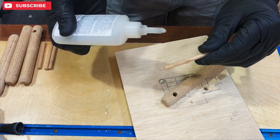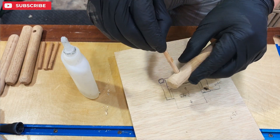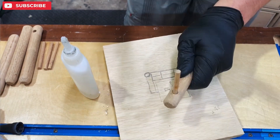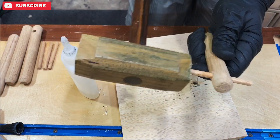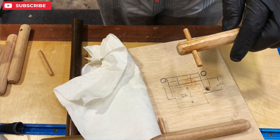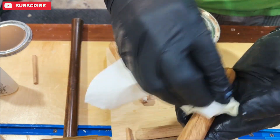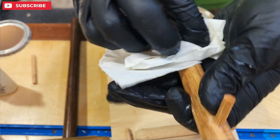Then I drilled a quarter-inch hole through the three-quarter-inch dowel and slid in a quarter-inch dowel into it, then held it into place with a little bit of CA glue. I learned this trick from James King on King's Fine Woodworking — a great solution, so I decided to carry it on to my cart. Then I finish it off with a heavy coat of wax, which will make it slide in and out of those pinholes very easily.